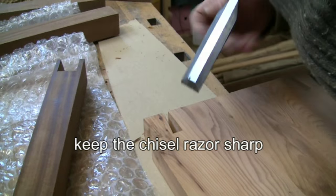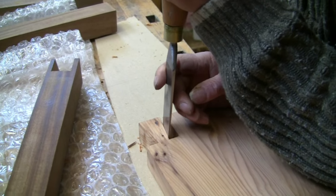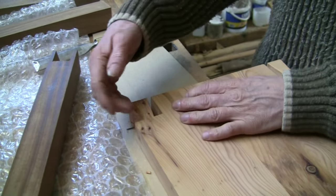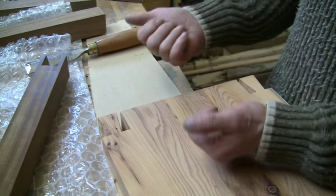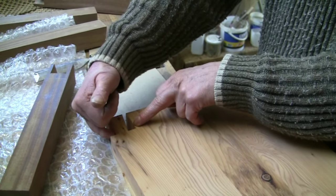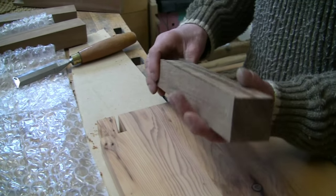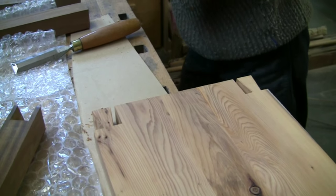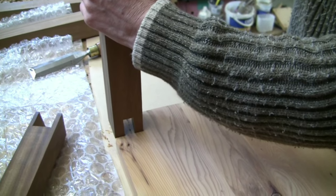What we don't want is either of two things happening. If a dovetail is too tight, because there is a fantastic amount of grip from the sheer physical friction, you can end up getting it three quarters of the way and not being able to pull the joints up really tightly. But on the other hand we don't want it loose - a loose joint is never going to be any good and there is always a risk it might work loose. After a while you get to feel when it's right.